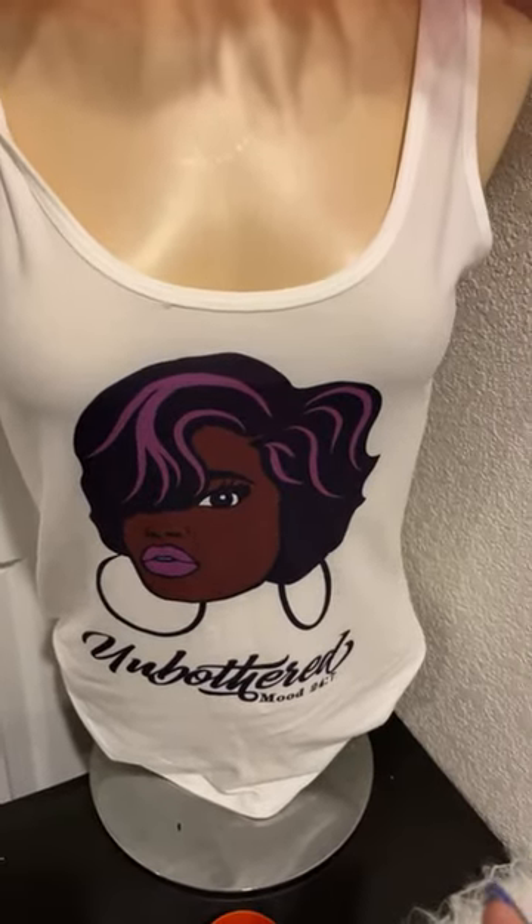So today I just did a nozzle check. I also found out about the power ink flush — if your printer has been shut down or you haven't used it in over three days, that's when you do a power ink flush. This ensures the ink is flowing, because the ink does get clogged in DTF machines. The ink runs through these little tubes from the ink bottles through the lines to the printer head.